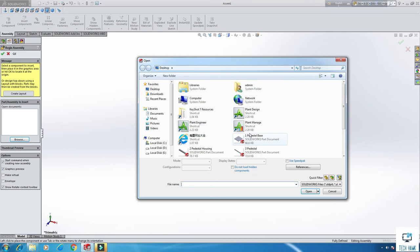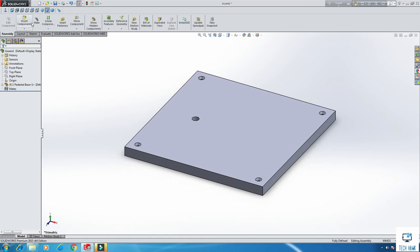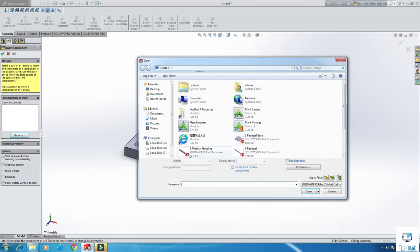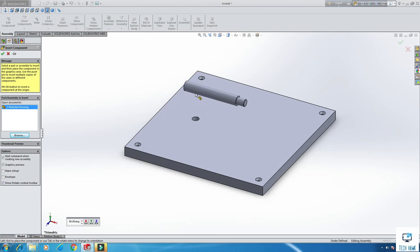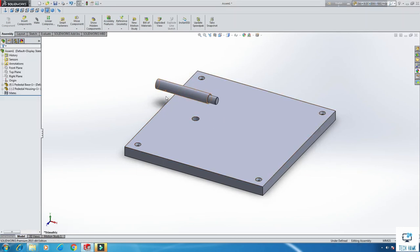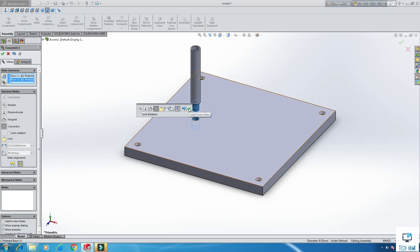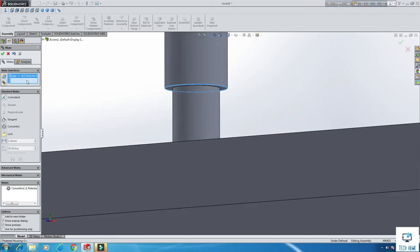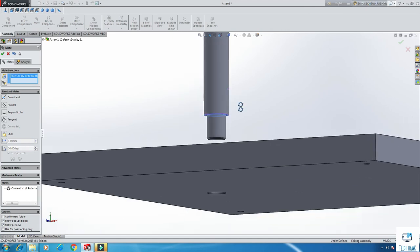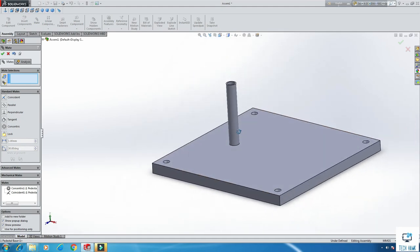first of all we are going to take the pedestal base number 1, save it here. Again we are going to browse number 2, pedestal housing, open. Okay, so from mate command, mate this face and this inside face concentric. Okay, and this, not that edge, this face and that face should be here. Okay,